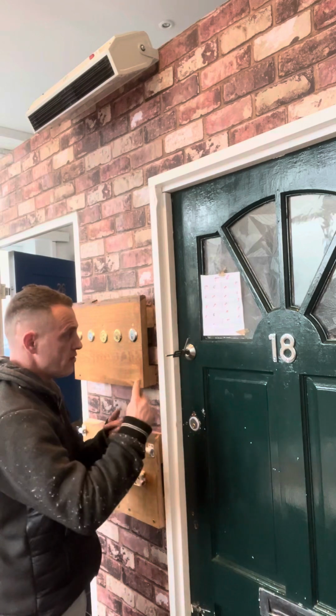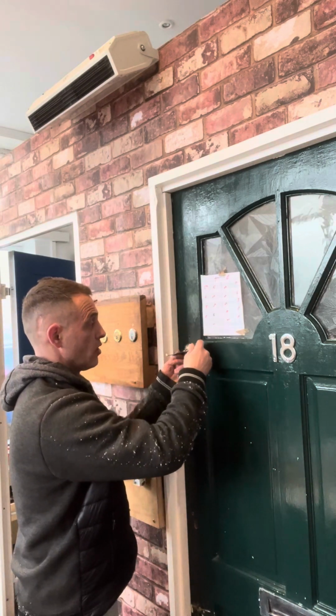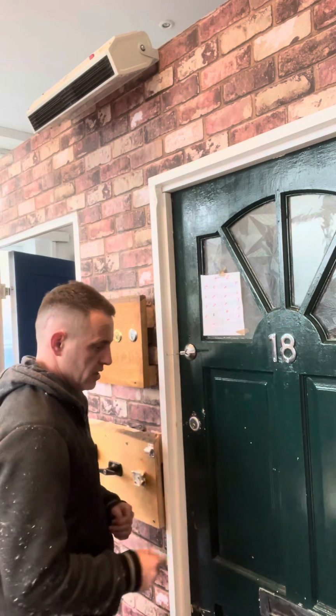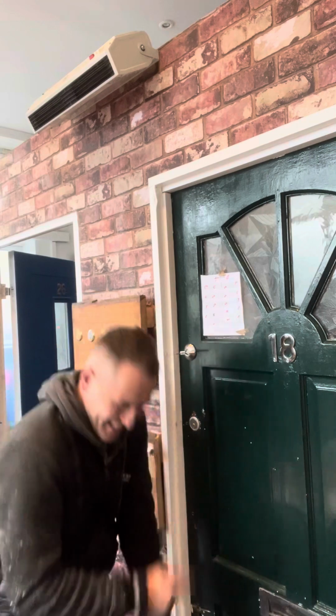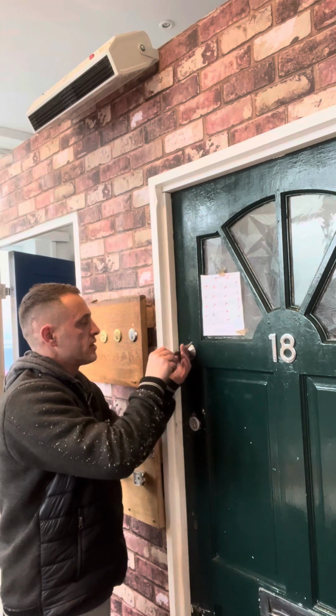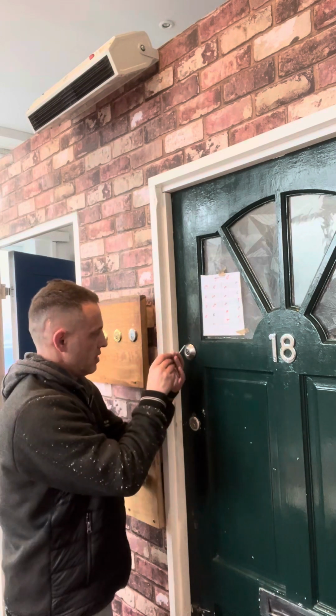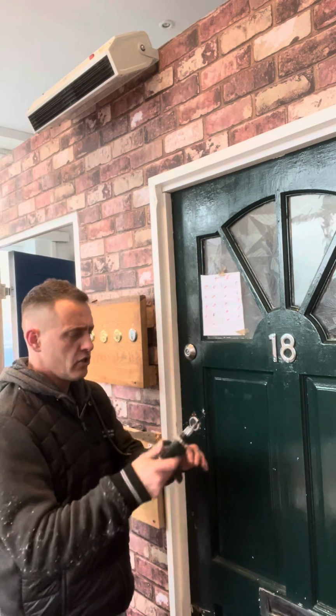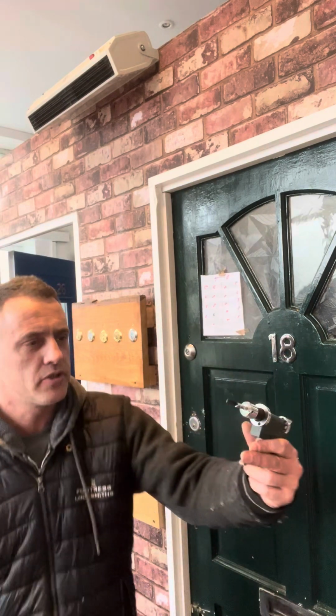Now, obviously, if I was to carry on rotating, so there's no spring pressure, I'd double lock the door and then I would be in a world of trouble. I remember doing that when I very first started. Bumping a night latch, didn't realise it had the double locking feature, bumped it the wrong way and deadlocked it, and then come bump it the other way, nightmare. Anyway, there we go. So we're going to take our tool out at roughly that position. Now we're going to use my trusty dyno plug spinner. You'll see that the end is absolutely mothered to death, but that's part and parcel.